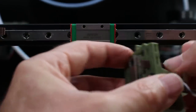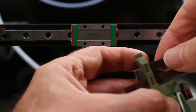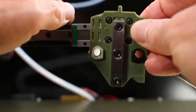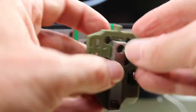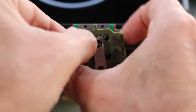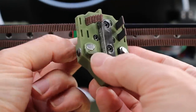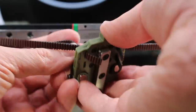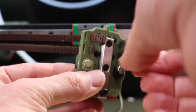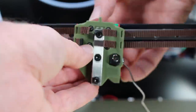Since the belts are loose, mounting is easier if you insert the belts through the back now before tightening down. Make sure the belts are fully loosened, and you should count the teeth — these should be equal from top to bottom and from side to side. Once you've got that worked out, you can bolt this down. Making sure these are perfectly even in terms of the number of teeth or spaces between the belt will make de-racking absolutely simple.